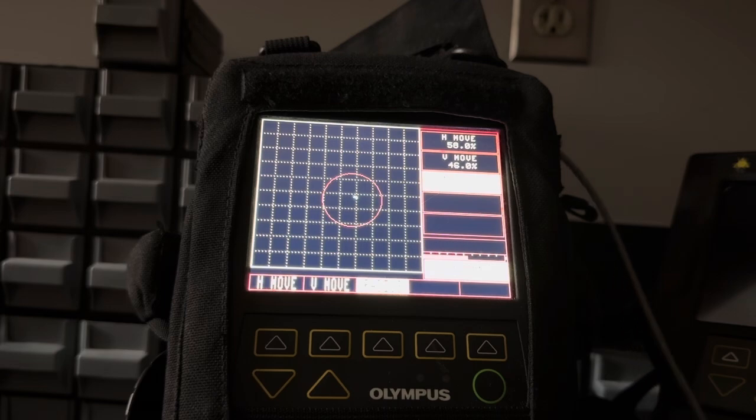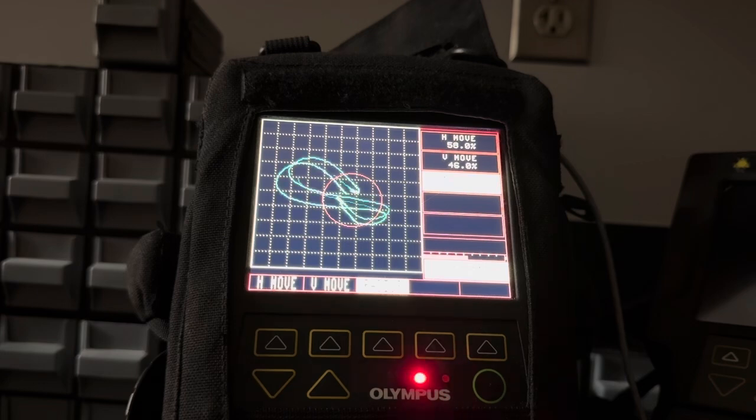I'm gonna try that on the second one too, because I want to make sure that's a little bit bigger crack maybe. So first I'm gonna go past the side of the hole with no crack. Ready? Here we go. No crack there. I'm gonna go past the other side of the hole 90 degrees away with no crack, no crack, no crack. I'm gonna go past the third side of the hole with no crack. Look at my null point, not doing much. But now I'm gonna go scanning past the side of the hole with a crack. Voila. You're not gonna miss that one either.